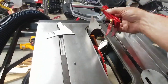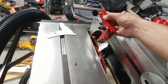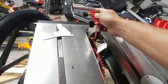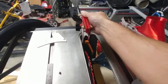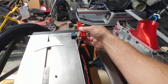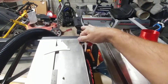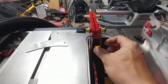This is pretty much the mounting bracket to accept the guard on top. You just have to have it loose enough so that the splitter fits in between those two red pieces. Then you tighten the knobs and put your two claws on. There are two little stop screws that keep them from swinging too far forward.